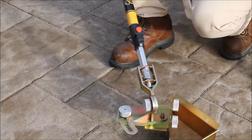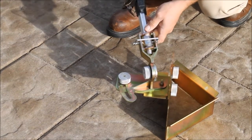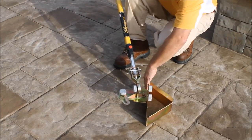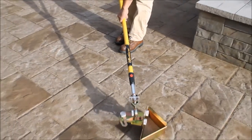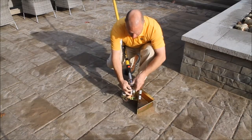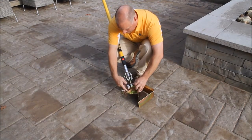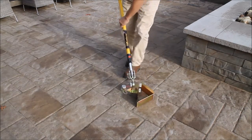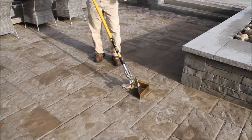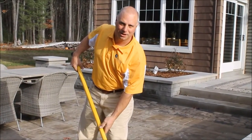It's got an interchangeable handle which fits many of our tools — you just slide that in and lock it in, it's got pins in it too. All you want to do is hold this against your cut edge after your pavers are installed, stand on the pavers, and drag it along the entire edge. I've got the angle a little low here so I'd adjust this up — just to show how easy it is. I'll go one more tab and tighten that up. Hold it along the edge and drag it — that pushes the sand away and gives you a nice, flat setting bed for your edging. Quickie Sand Plow by PaveTool.